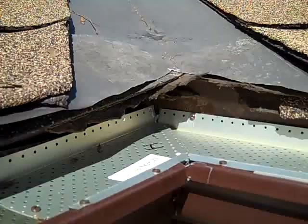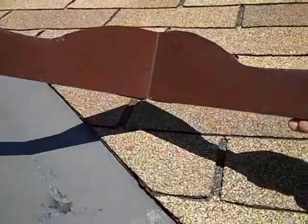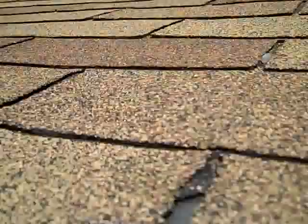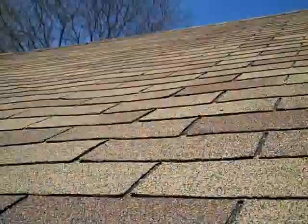So what we need to do is put in a stop that's gonna stop that water from flowing over the front. It's called a valley diverter. This one here is a fairly substantial one due to the height difference that we have there. So this is dismounted in there, we will screw that down, and that's gonna be a stop for the water.